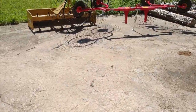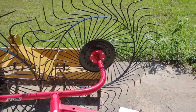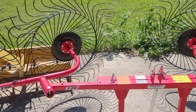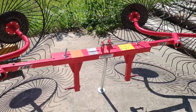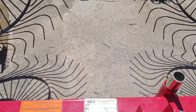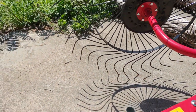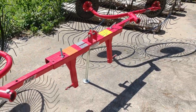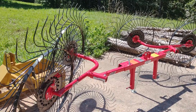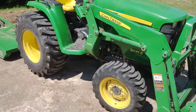Now this — the four-wheel V-rake — I consider it not the greatest piece of equipment. The problem with it is that by the time you get the two wheels far enough apart to make a windrow where they don't catch grass and flip it into a big bundle, you're too wide for your hay pickup. So you wind up having to rake it twice. I haven't figured out how to do it in one rake yet. Made in Italy, weighs 260 pounds. We're semi-satisfied with it — it's not what we'd hoped, but like I told John, I'm not friends with it yet but we're getting there.